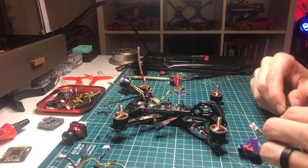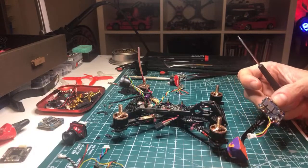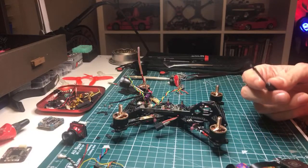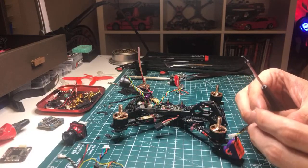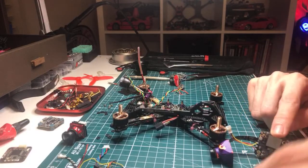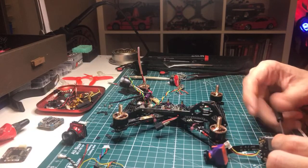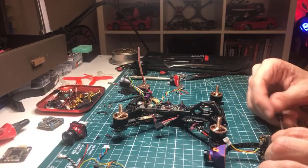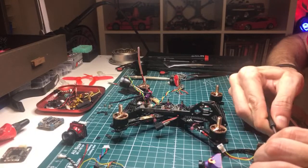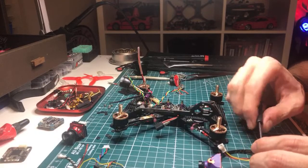And that's kind of fascinating, because what my dad basically said when I asked him about the whole voltage thing is, I explained the whole situation. He goes, all right, well, is anything getting hot? Is the XT60 getting hot? Are the wires getting hot? Is there heat anywhere in the system? And when I said no, he goes, well, then there's really no reason. The only real reason to bump the voltage up would be if there were losses via heat, because that's pretty much the only way you get loss with electricity outside of the work that it's doing, right? In our case, the thrust that it's producing.